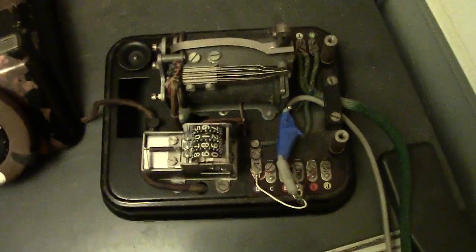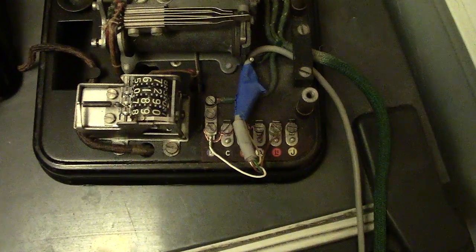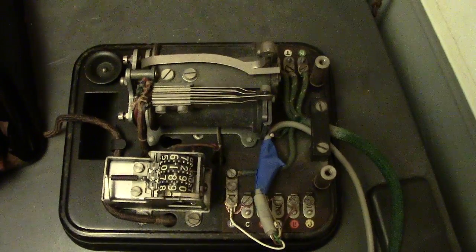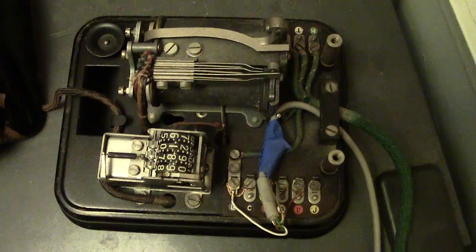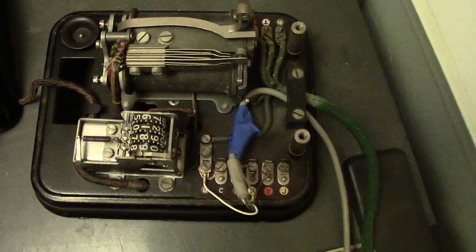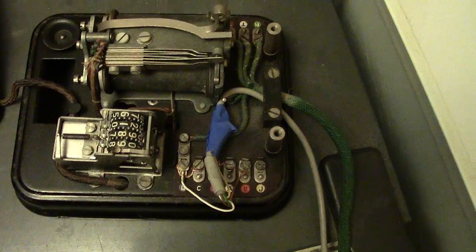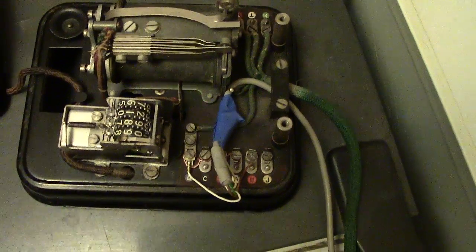Right, the final video hopefully on the Danish phone. I had to work out the actual circuit diagram. It wasn't too difficult — just tapping around with a good old AVO on the ohm scale to find where all the bits went to.